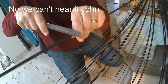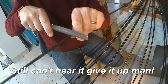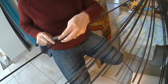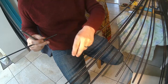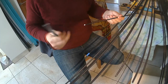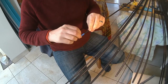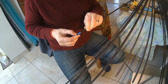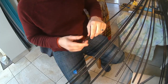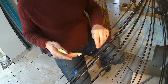There - it's quite quiet and you can listen. We're nearly through now all the way around. There's just a tiny bit of carbon fibre still clinging on. If that piece is to be discarded, you might want to reuse that tip - probably won't be able to there. What I tend to do is take the tape off. The file is still reasonably aggressive, so I'll take some sandpaper - this is 180 grit, but it doesn't matter as long as it's not really coarse.